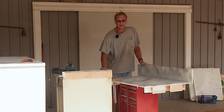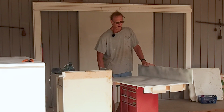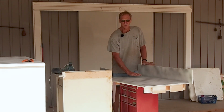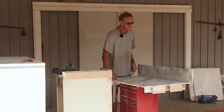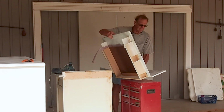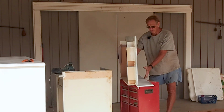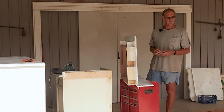One thing when you're doing any kind of epoxy work is your pieces have to be extremely level where you're pouring the epoxy on. This piece has a back part on it, so I will have to do it in 2 pours. I'll have to get this level, pour the epoxy in it. We'll show you that later on. Then flip it up, get this piece here prepped, and pour epoxy on this, so then it becomes a seamless epoxy pour between those 2 pieces.